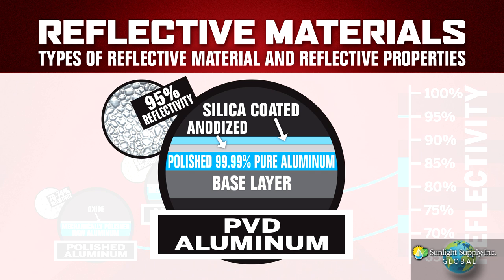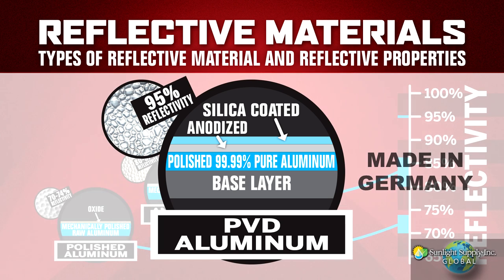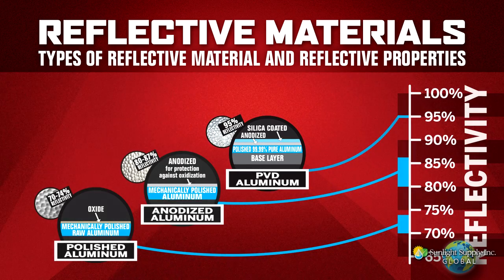The highest-grade material is known as PVD aluminum. This stands for physical vapor deposition, which is a high-temperature vacuum evaporation process used to deposit a thin layer of highly reflective 99.9% pure aluminum on the base aluminum structure. The material is then anodized and finely top-coated with a very highly reflective silica glass. This results in a very strong, hard surface coating resulting in an incredibly efficient reflective aluminum material rated at 95% total light reflectance. The producers of the PVD aluminum warranty the product for a full 25 years.